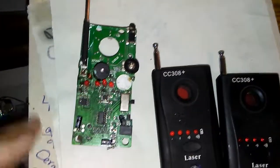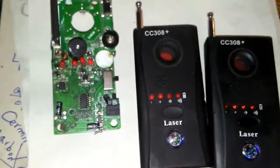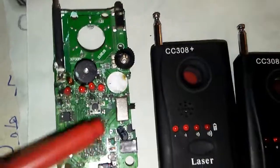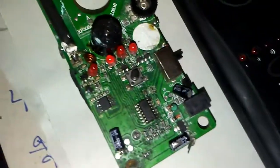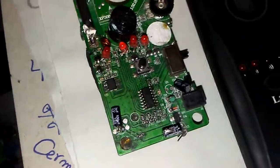The LM339 will drive the four LEDs here. I have several videos about the LM358 RF detector. We have one volume control here to adjust the signal level, and also two modes: one with vibration and the second switch type is without vibration. I made some changes for this device and tried to replace the LM358 with the 8623.